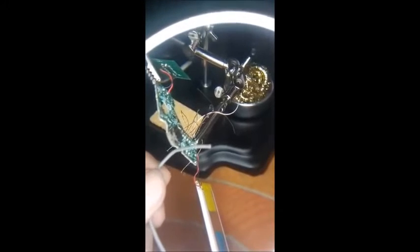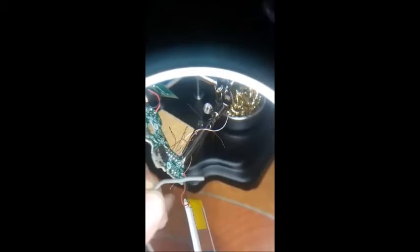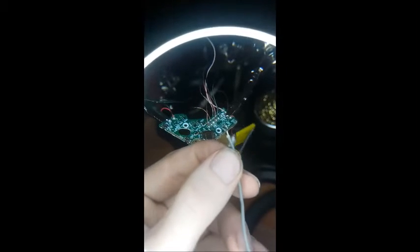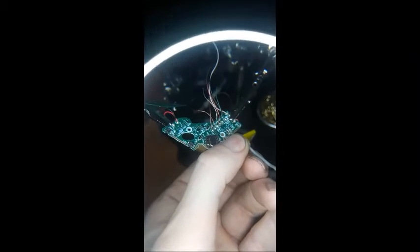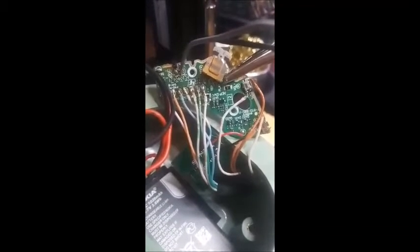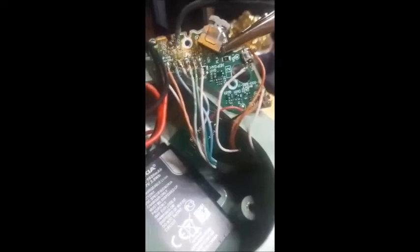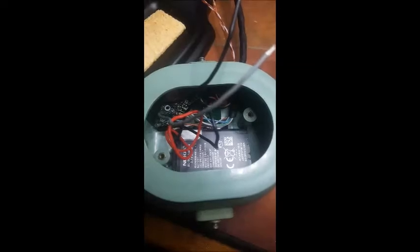The speaker coming off this little PCB is the right ear. Going to go with automotive colors and use gray for right front. Had to trim and thin the wire out because it was a little large for the pad, but now it's a nice fit - this is heavily magnified so it's quite fiddly. Every time you move this thing wires break because they're only small individual strands. You want solid core so they stay, but they're just so tiny they act flexible and break when you twist.